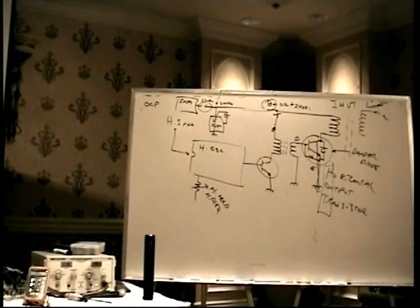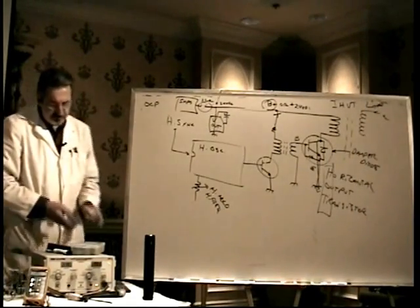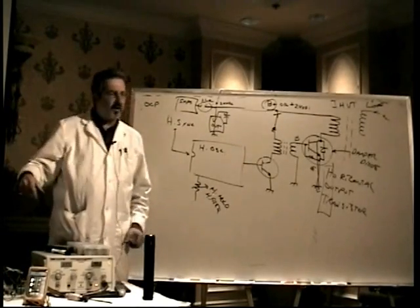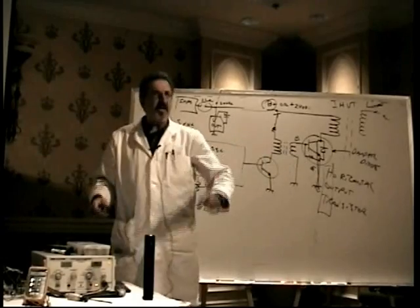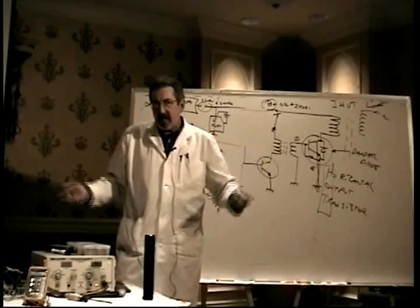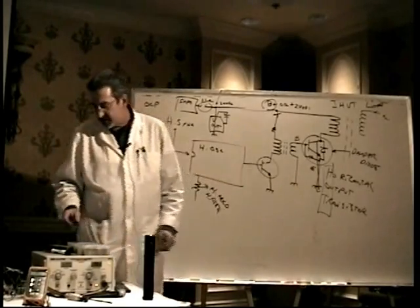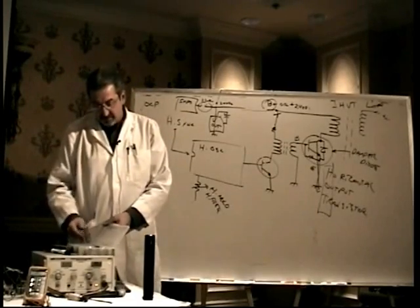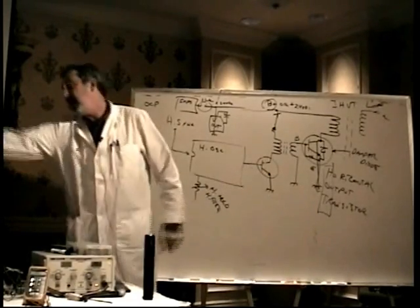That's the deal. There are a number of different horizontal output transistors that exist, but quite frankly, they're fairly interchangeable. They're not totally interchangeable, and I have a few different part numbers that are horizontal output transistors. It's kind of like if I have a 19-inch monitor, I could take a horizontal output transistor from another 19-inch monitor of the same resolution, and it works, more or less. There are some exceptions to the rule, but I routinely just try one. In other words, I've got a bad HOT. Well, I don't know, try that one, see if it works. And if it works for 10 minutes and then blows out, well, try that one, see if it works.